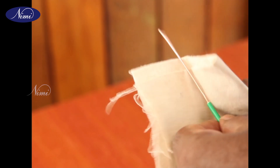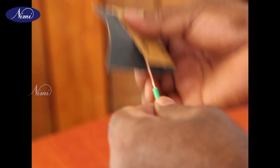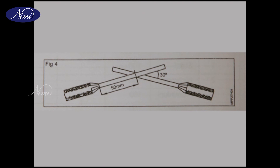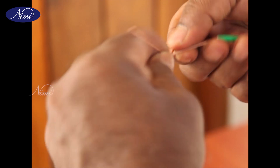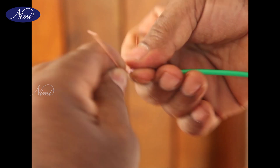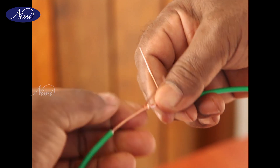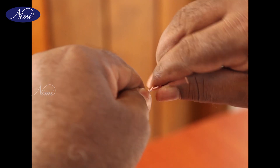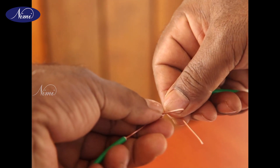Step 5: Clean the ends with the help of cotton cloth; use smooth sandpaper if necessary to clean the conductor. Step 6: Place the conductors together about 50 millimeters from the ends. Step 7: Twist them tightly round each other in the opposite direction. Each twist should contain about six turns; each turn of a conductor should fit closely to the adjacent turn.